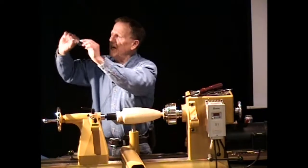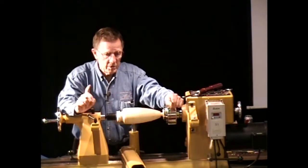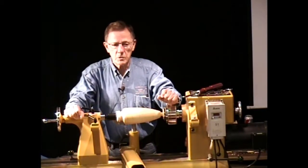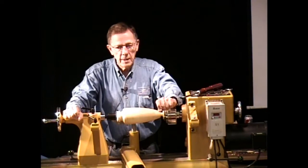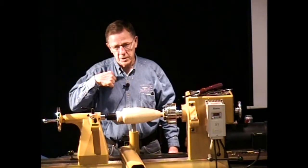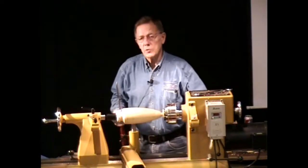At the end of the day, if I do that with my glasses and hold them up to the light and I see dust particles on my glasses, something was wrong. If I see, as in this light's pretty bright, if I see that dust floating around the air, something's wrong. The second it's created here, it should go right in there. And that's the way we work. Everything else falls on the floor, but that fine dust, the stuff that kills us, the stuff that gives us problems, is trapped and picked up.